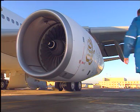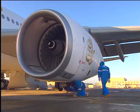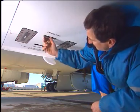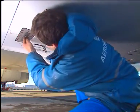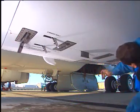You must first follow the safety precautions and prepare the aircraft to operate on engines. Release the deflection restraint on the leading edge of the fan cowl door. Release the four fan cowl door latches.